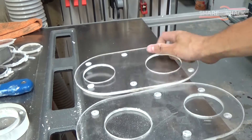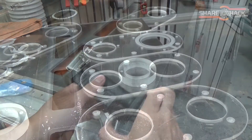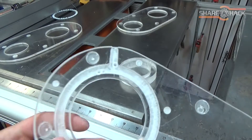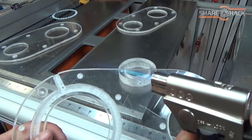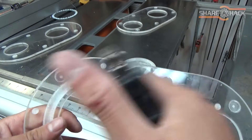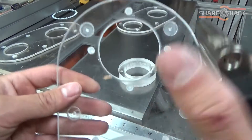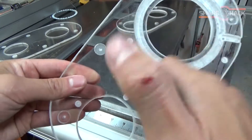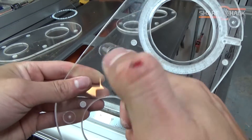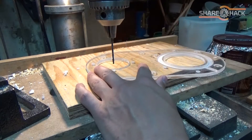The parts are more or less cleaned up. One cool little trick you can do is torch the rough parts of the acrylic really quickly to clear them up. But in the end I would not recommend doing this, because too much heat can cause little stress cracks in the plastic. You don't see them right away, but later on when you polish it they become more apparent and it just doesn't look as nice — you'll see what I mean later on in the video.